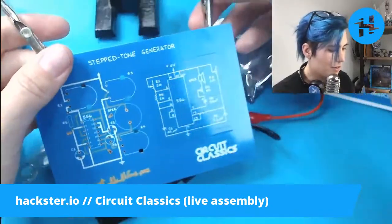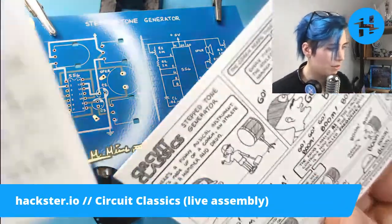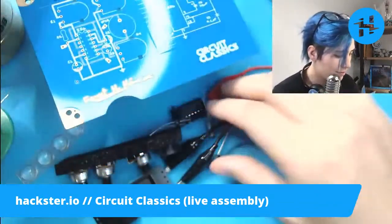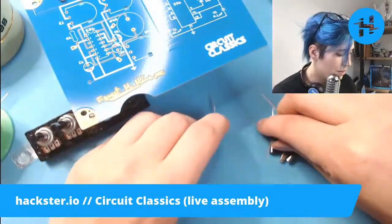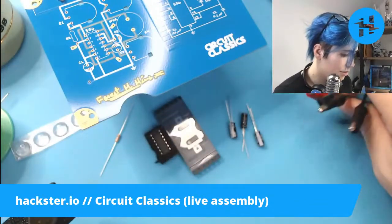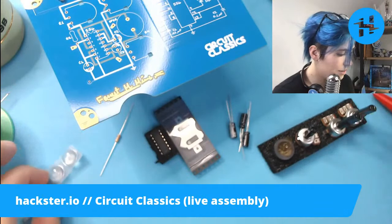So let's see. Do they have directions for what order to put this together in? I haven't seen one. Without that, typically what one would do is start with the lowest raised pieces and go along to the highest ones. So I'm going to start with the resistors probably. Well, there's only one resistor actually, except for the variable resistors. So we've got resistors, chips, probably do that next. Then your capacitors, save these alligator clips for later. Then your really tall things, the buzzer and then the pots, I think. And then we'll put the feet on and hook it up. Cool.